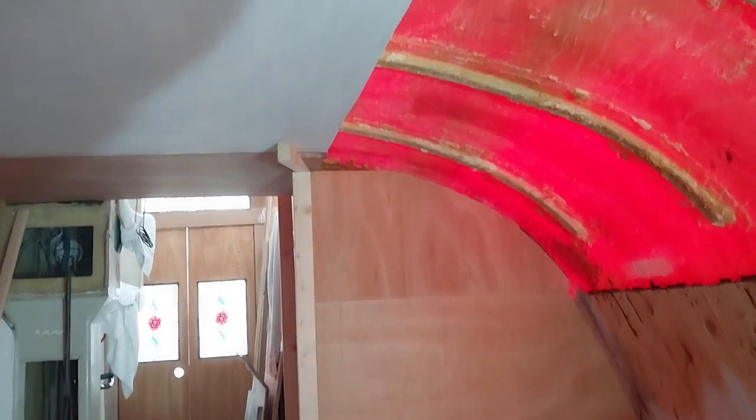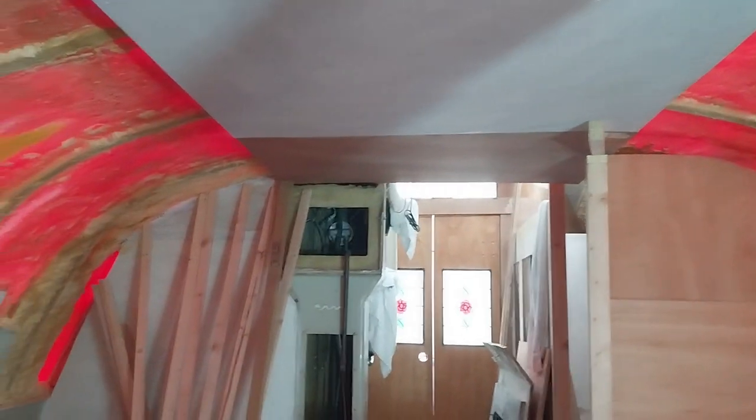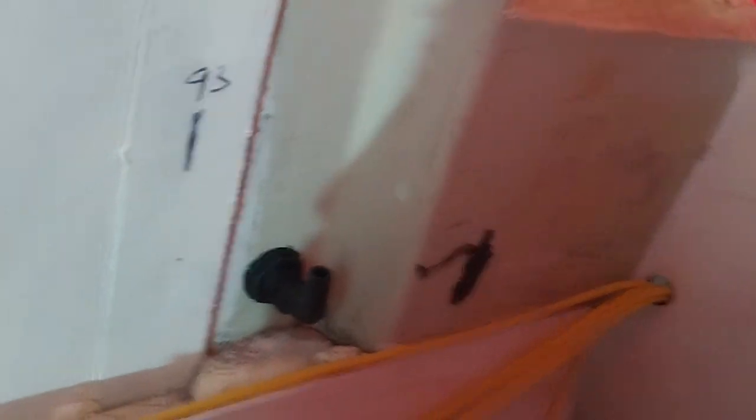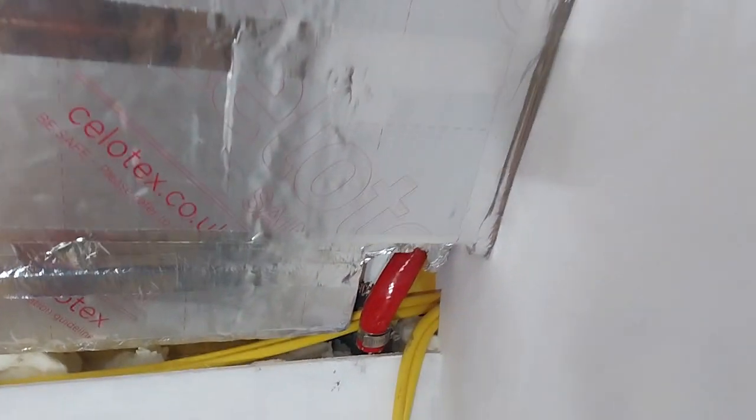So, the tray for the solar panels — as I've shown you before, there's a slight lowering in the ceiling of about 65mm where the solar panels are going to be sitting in. And that being kind of a tray, it needs some drains, so this week we have been putting in the drains, which are basically skin fittings with a 90 degree hose tail on it, from which 90mm hoses are going to take the water away. There's one already connected — a bit difficult to see but it's there. They'll be plumbed into the tray and take the water away. There are three on each side: front, back, and this is the middle one at the bulkhead where the galley will be.